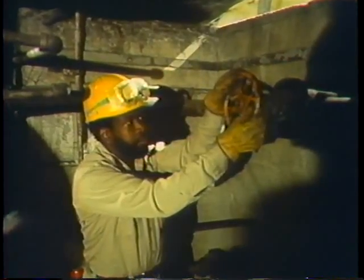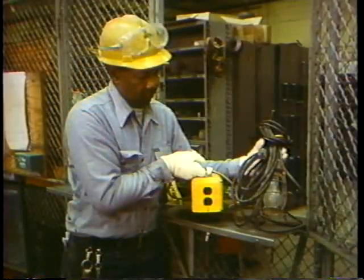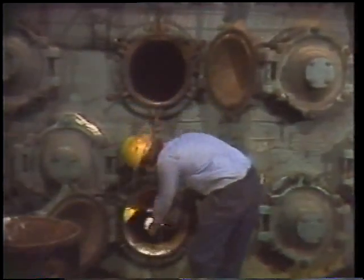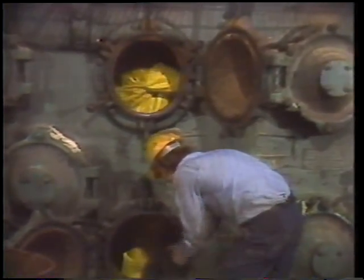In this part we've looked at preparations such as draining the condenser, shutting off valves and pumps, choosing tools and equipment, and opening up the unit. We've also talked about safety precautions like tagging out equipment, special safety lighting, air testing, and the two-man rule for working in a confined space. These procedures also apply to work on large shell and tube heat exchangers. In some cases headers are opened up, so the confined workspace problem doesn't exist, but gases can still be present as the head is coming off.